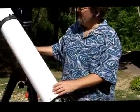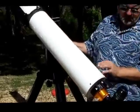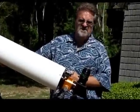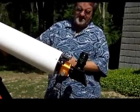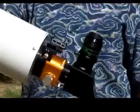You saw this scope originally when we had it out here at Tom's shop in its original condition, retrieved off the club floor up at Etoka. We've taken it down and had a fellow paint it with some nice white enamel, and we've replaced the original Unitron focuser with a nice two-speed Moonlite focuser. Today we're putting it through its paces, taking a look at the sun with a Baader Herschel wedge on the back of it.